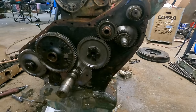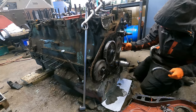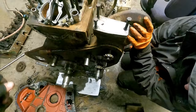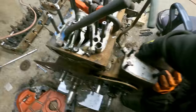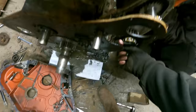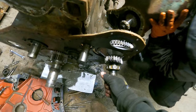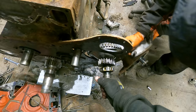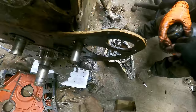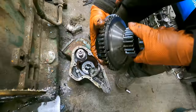We'll carry on pulling this apart. That one at the top, Josh, this one at the bottom. I'm going to go with like five roll pins. Right, here comes the supercharger housing. I might need a hammer for this. Is it heavy? I'm thinking those gears are going to try and run away. Oh, I found the goo. That gear's running away. Will it pull out? Nope. Yep. There's your flex drive. It's going to make a mess either way around. So, our supercharger is soft coupled. No, it's not. No, it's got a fancy bearing. There it is. Yeah, just a bit there that takes out the shock.